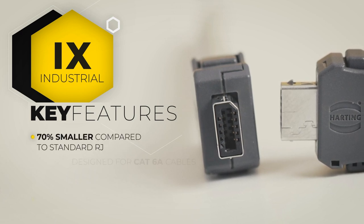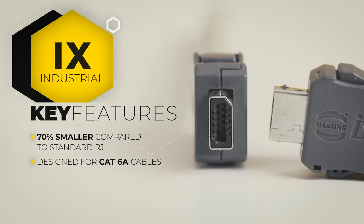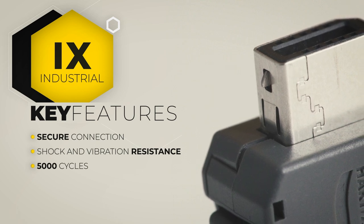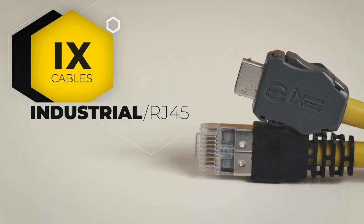We've been talking a lot about the miniaturization of connectors, but one can ask: why RJ45 for Ethernet — why can't it be smaller? Look at the changes of USB, for example. Harting's iX Industrial is 70% smaller than the standard RJ45 socket, and yet it is more robust and offers Category 6a performance for 1 or 10 Gbps. On the sides, two snap-in metal hooks secure the connection. It is resistant to shock and vibration and designed for at least 5,000 mating cycles. This RJ45 mini can be assembled with the iX Industrial mating face on both sides or mixed.